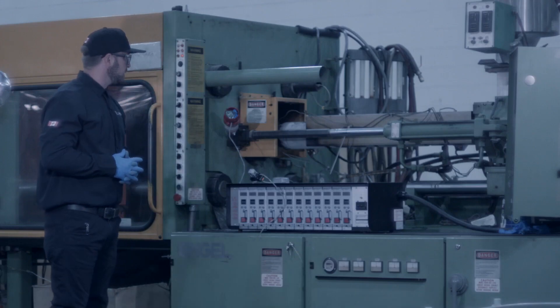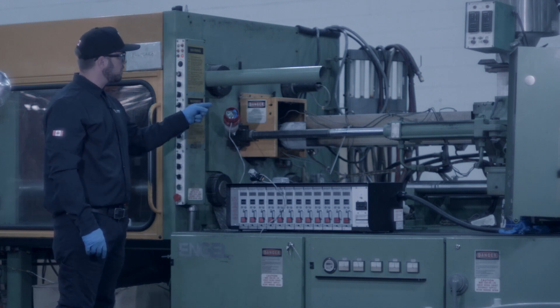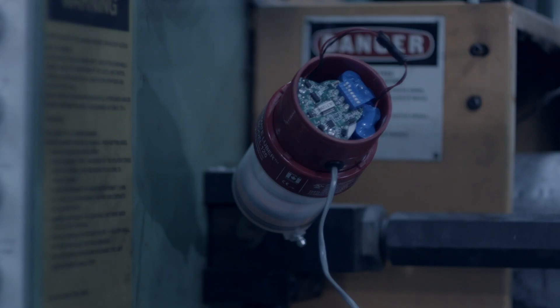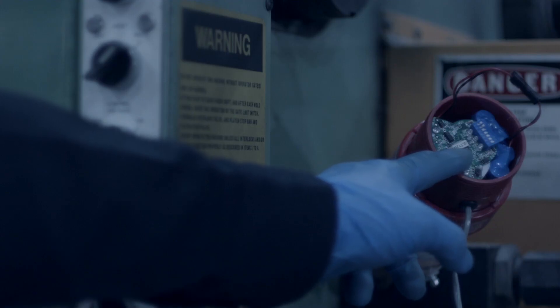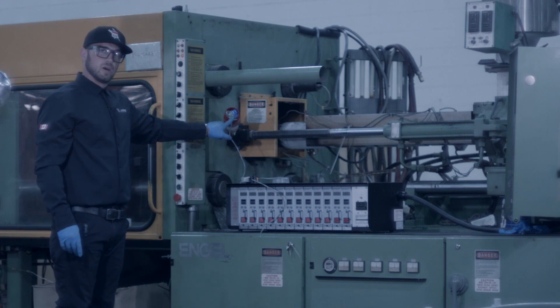The injection molding machine is shut off and it's going to be in pause mode. When it's in pause mode it's going to produce two blue flashes. As soon as I put this machine into operation it will exit pause mode and it will resume its natural lubrication cycle. Whenever that cycle is ended it will dispense its grease and it will start the cycle over until I shut this machine off.